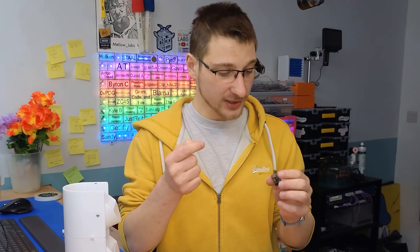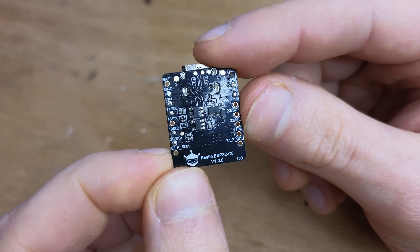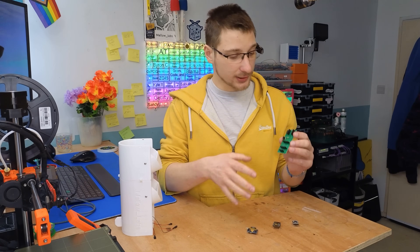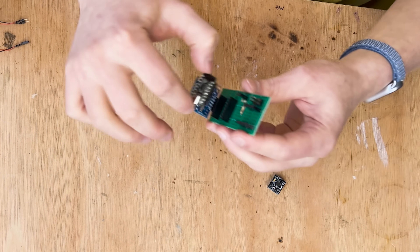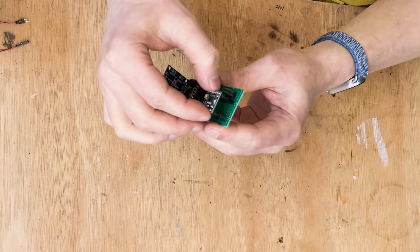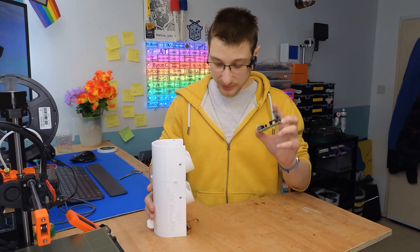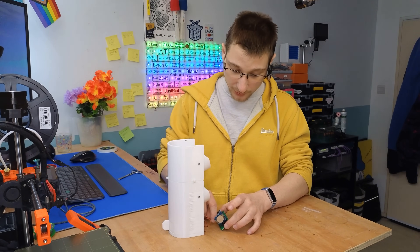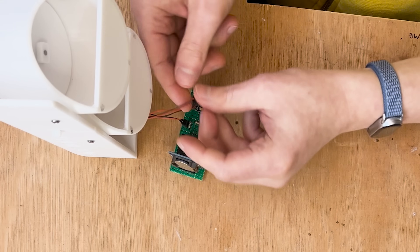For the microcontroller I'm using a DF-robot ESP32C3 Beetle — for no other reason than I have it and I like it. To make assembly go faster, I made a little circuit board which holds the real-time clock, the microcontroller, the motor driver, and the two resistors are already soldered on. The schematics are available with the 3D models, so now all I have to do is plug it in — piezo goes there, then motor 1 and motor 2.